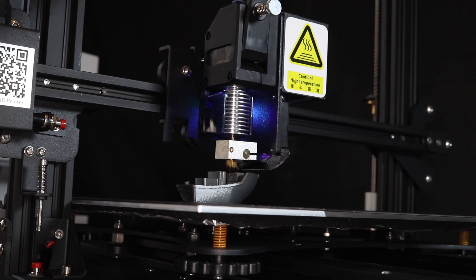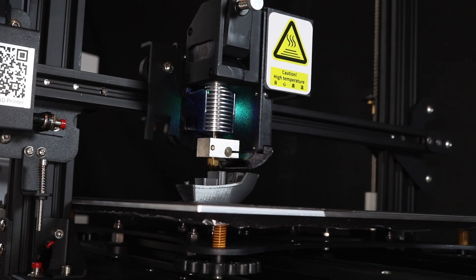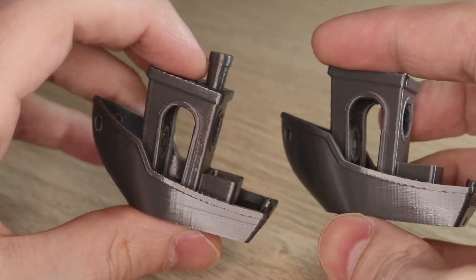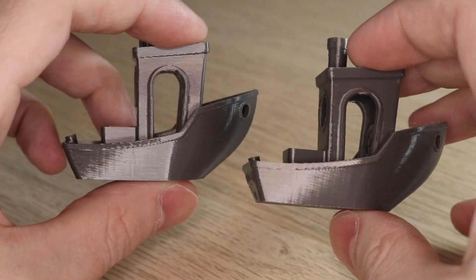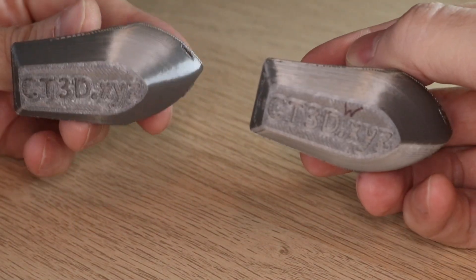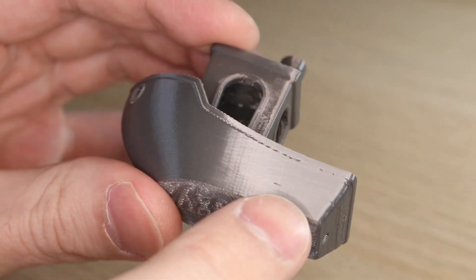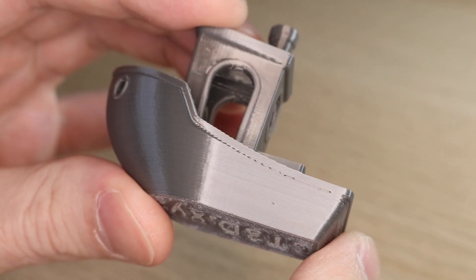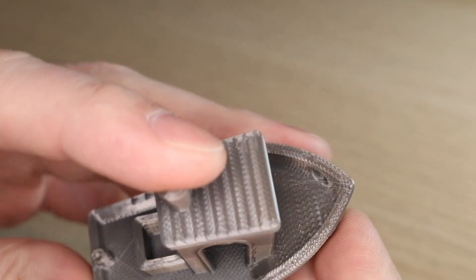Typically, when printing with material that's absorbed moisture, you'll hear a crackling or a popping sound as all the moisture absorbed into the material is expelled as steam when it exits the hot end. Not only did I not hear any of that during printing, but I was surprised to see that the parts looked almost completely identical. There's a small amount of stringing, but it's present in the same place on both models. The only real defect that gives it away is a little pockmark typical of wet filament, usually caused by the beginning of an extrusion line where the nozzle hasn't fully primed — you get a void where there should be material.